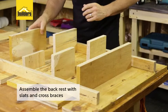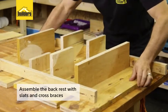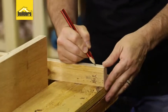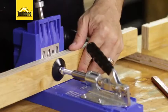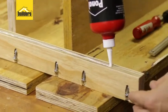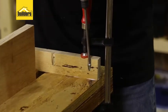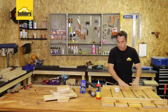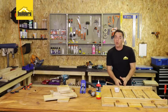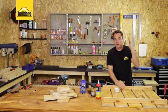We're going to be doing our backrest, which is exactly the same process using the same size spacers. I've got two cross braces here which are 770mm long — we're going to put those 75mm in from the sides. I'm marking it now so I know exactly where to put the pocket holes. In go our Kreg screws, glue on the mating surfaces, clamp it into position, make sure your spacing is correct, and there's our backrest frame. Whilst I've got it upside down, I'm going to put on my hinges and drill the hole for the pivot which will give us the different height adjustments.